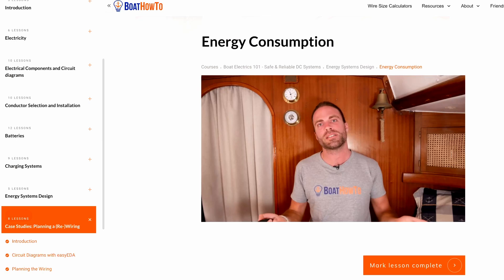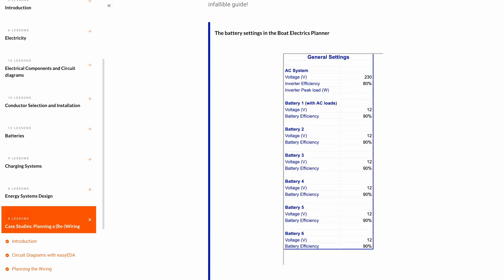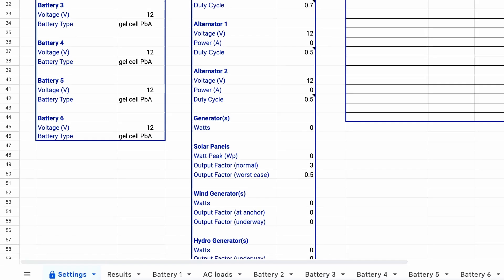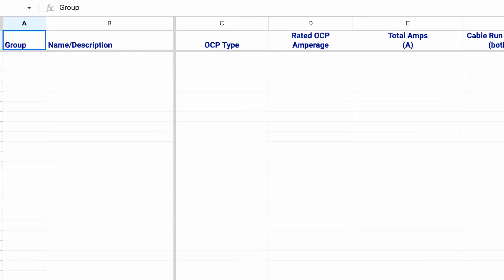The first thing that has to be done is figure out your lifestyle, then figure out what the energy needs of that lifestyle are. We have a whole module with our energy systems planner, which is to my mind the best planner of its kind available, where you can put all your loads and how long you use them and then figure out conductor sizes and overcurrent protection and all that kind of stuff. You really need to go through this whole energy audit exercise to figure out how many batteries you need, what kind of charging devices, how big the conductors are going to be, and then you can generate a proper design and wiring diagram for the boat.